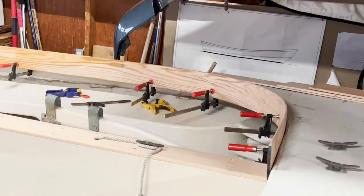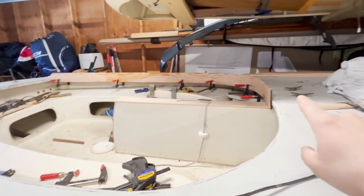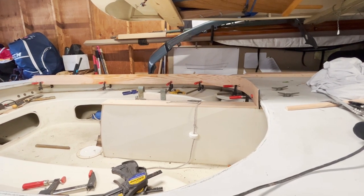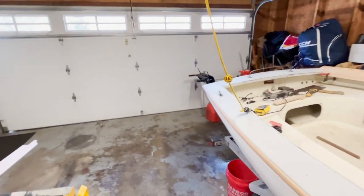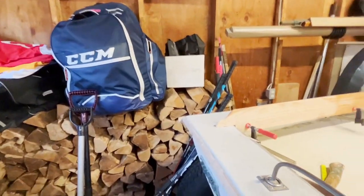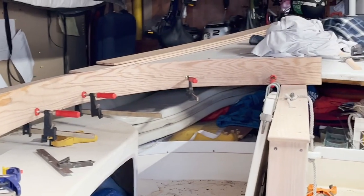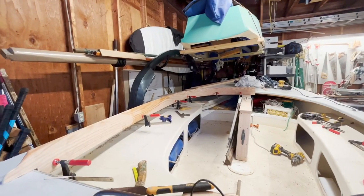I think I've got it. Stepping back, it's sitting a little lower than I anticipated to make it square across the centerboard trunk, but as long as it looks okay, that's probably how the other one was — it was measured off of the old boat, so that's where it was. I think we're okay. Let me get some screws and get set up for the next step.